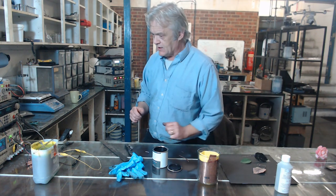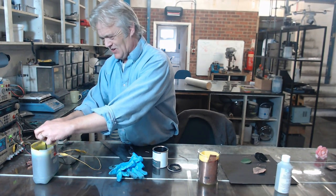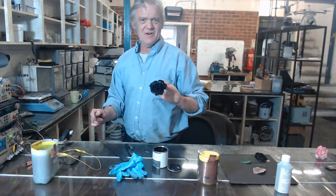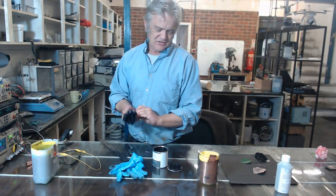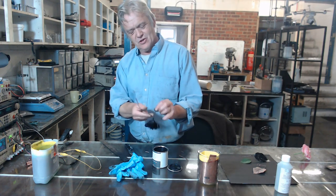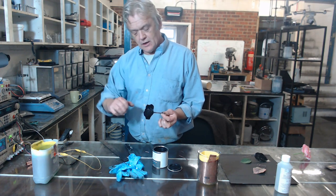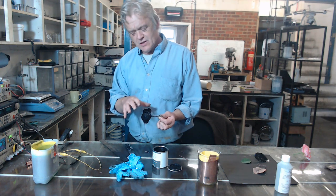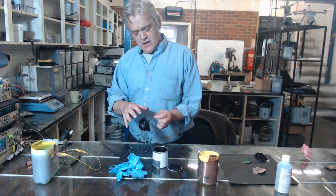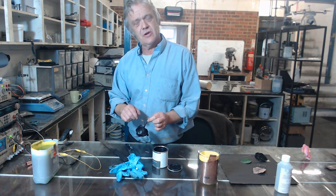I equally did that here, which I've just started. Here is a flower that I dip-coated — I took this flower, dipped it in there, let it dry, and I get a conductive coated flower. The good thing about the dip-coating method is that I don't have to try to get a brush into everything. If I tried to brush it, I'd probably destroy the flower because it's quite delicate. The ink forms a nice coating over it and gets all the surface detail that you would otherwise lose.